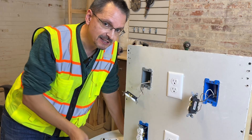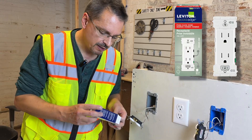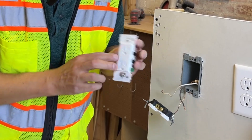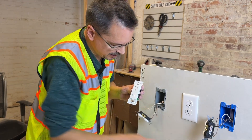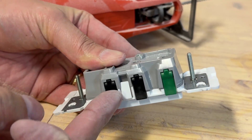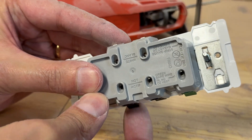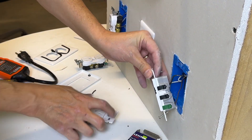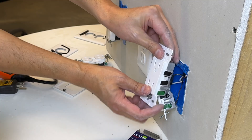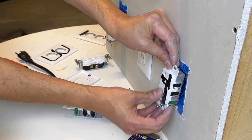But what about that number four surprise? Have you ever seen the Leviton Decora Edge before? Leviton is a very well-respected name when it comes to outlets and receptacles. It comes with a wide attachment point no matter what size box you're working with, and uses a rectangle-shaped Decora cover plate. Look at these color-coded spring-loaded levers on the side. The black is where your hot wires go, the white is where your neutral wires go, right into these slots. The green is for the ground. They've thought of everything — even the direction these levers open, so that as you slide the outlet in, the wires won't pull on and loosen the connection. The levers open from the front so nothing obstructs them as you push the outlet back in.